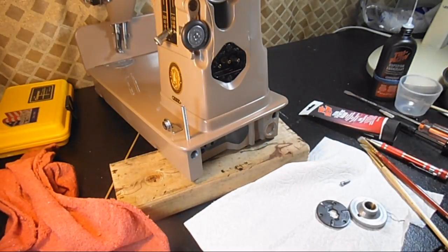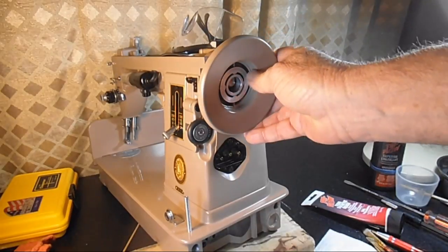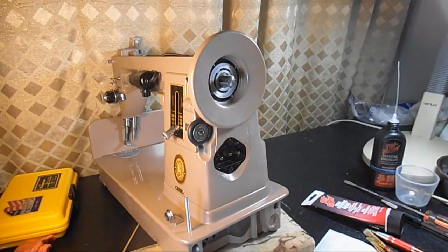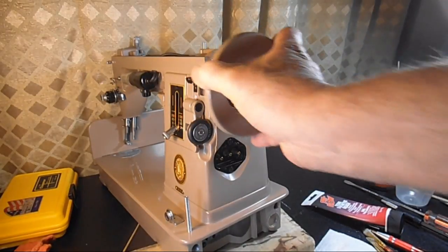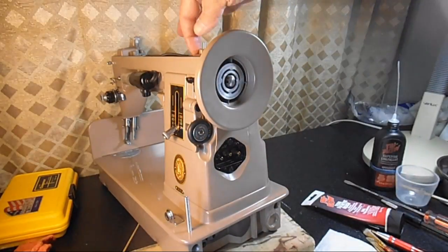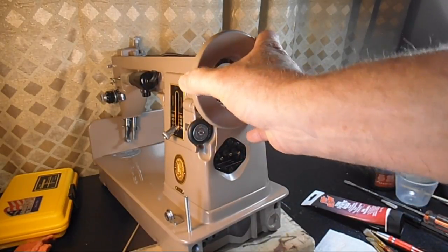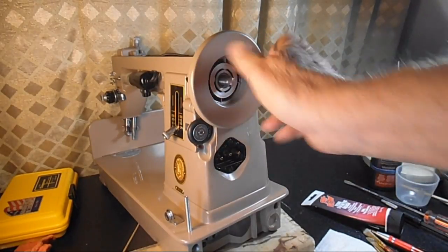I'm going to take the hand wheel and slide it onto that shaft. Since I've already put in the motor, it's going to have to mate with that pinion gear. And it just slid all the way back — what you're hearing is this metal ring right there hitting the back of the casting and the shaft bushing. So it's going to be mating just fine. Sometimes when you get back to that pinion gear you may have to push it back and forth a little or jiggle it or wiggle it, but it's in there good now.